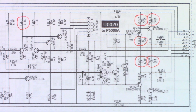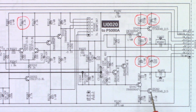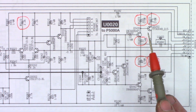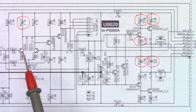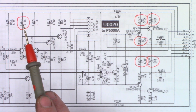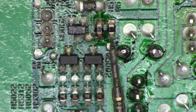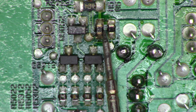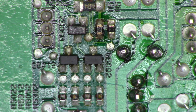I had to print out a schematic on this unit. Over here you'll see the shorted capacitor that I replaced, the 82-ohm, 33-ohm, 220-ohm, and 2.2-ohm resistors that were all defective. The drivers and pre-drivers test absolutely perfect. However, doing more checking, transistor Q5002 tests leaky, and I have a 2.2K surface-mount resistor that also tests bad. I'm going to replace both 2.2K resistors and both of those transistors since they're exactly the same. I've got those parts on order and once they show up we'll go ahead and finish this repair — hopefully this thing will be solid.